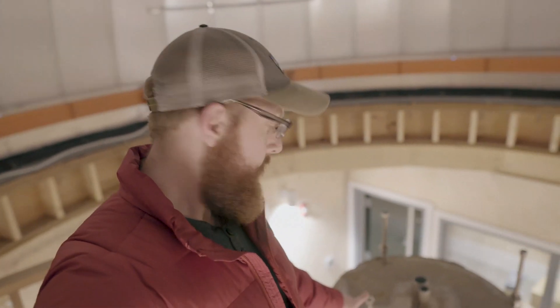We're here inside the dome for the 0.7 meter install. Behind me is the actual pier with the bolts. Before we do the installation, we need to make sure that the south mark — which is this bolt — is going to be aligned due south, which it is. I'm going to organize the actual nuts and washers so we have even spacing. That means the 0.7 meter will be installed level, and we'll finalize the level tomorrow once the system is actually attached.